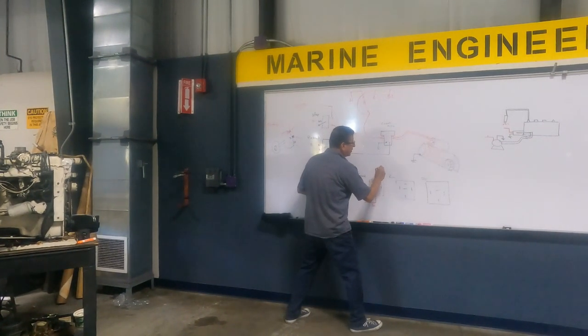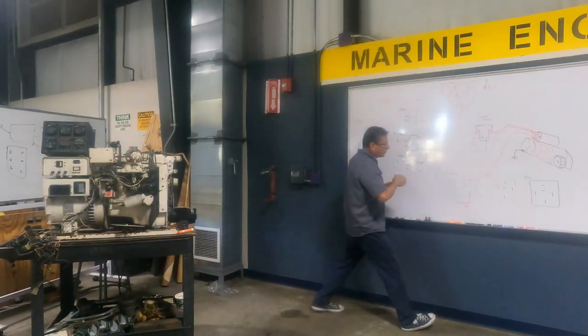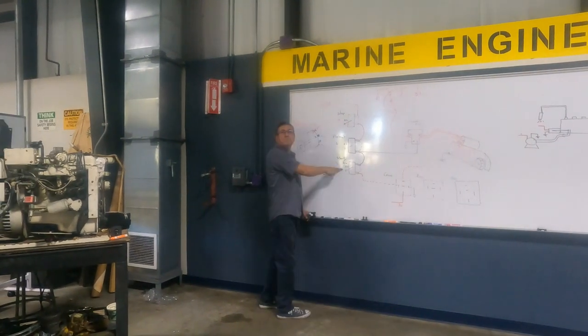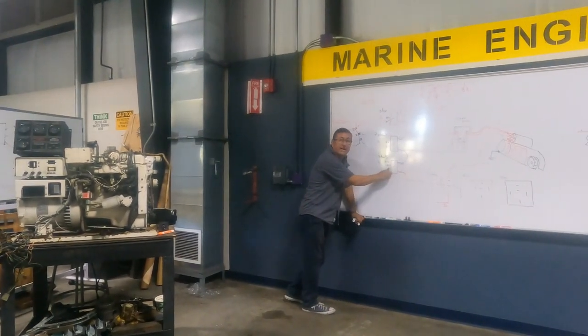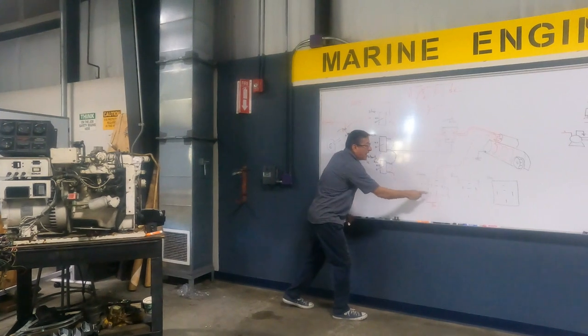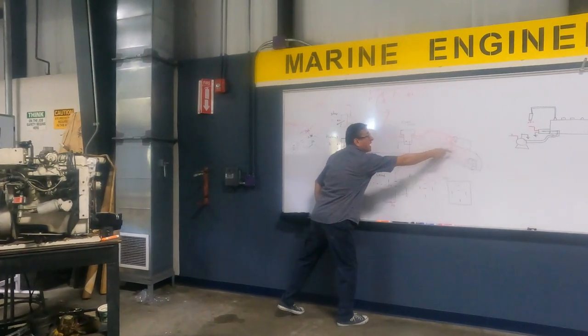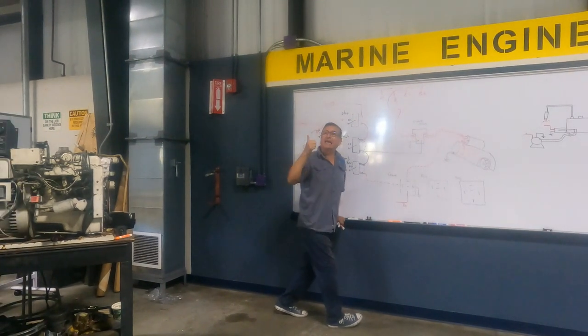I want to send that signal with a yellow-red cable here. And, of course, this relay is powered from this momentary switch. What is the meaning of that? Guys, if I press this momentary button, I send current here, and what happens with that 12 volt signal? It passes over there, and what happens with the starter motor? Crank, crank, and I have cranking.